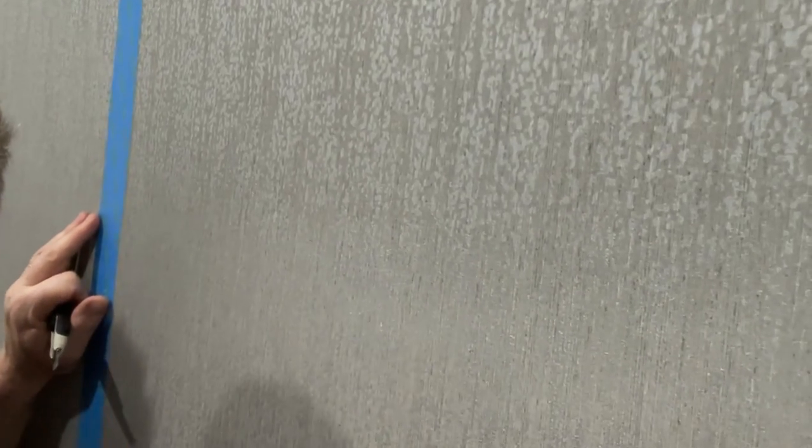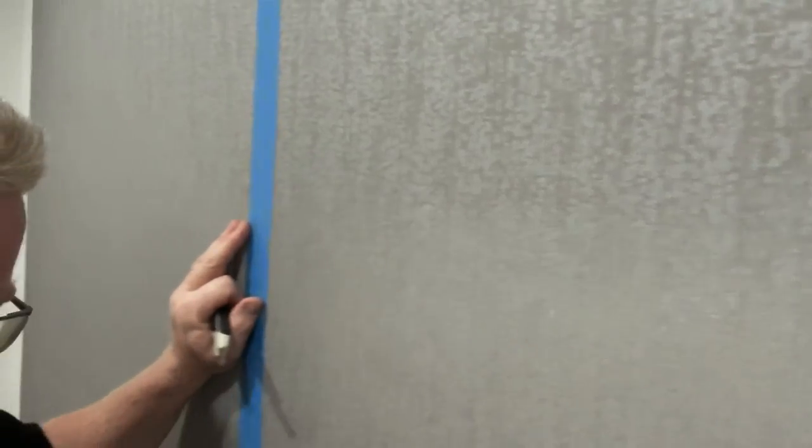I mention this procedure here because the wallpaper is thick. This vinyl is thick and it has its own grooves. If you try to go too quick and your blade gets a little dull, your blade is going to jump into one of these tracks and it's going to go in the direction of going off of the straight path. This will help you.